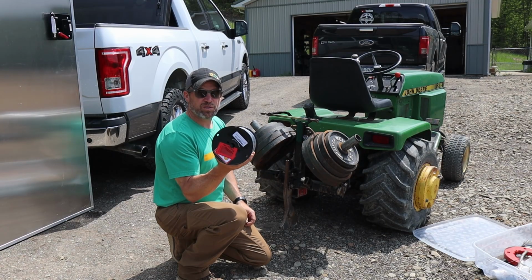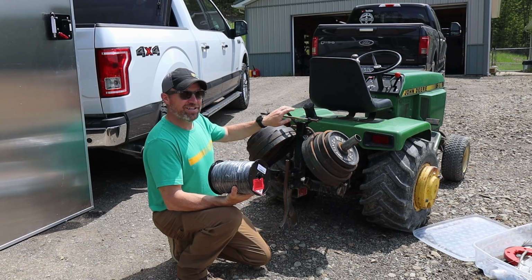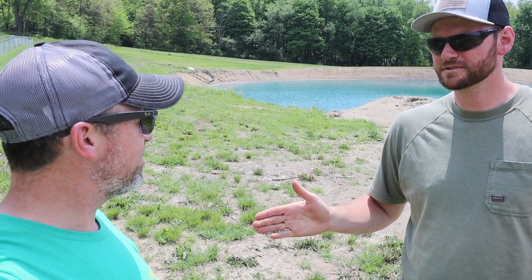Okay, we're just getting everything scoped out, what they want to do. That's kind of the first step when you want to do a dog fence, is to make sure where you want to put it, measure out your perimeter, and then you can determine how much wire you're going to need and the path you're going to take. You obviously want to avoid as many tree roots as you can and any rock situations or things that get nasty to pull a little knife through in the ground. So Adam's going to enclose about 2 acres or more. I bought two 1,500-foot spools, and I modified this just before we left so that it would accommodate a 1,500-footer. Yeah, because you said, barring any of those obstacles, this wire will be in the ground as fast as you can drive the tractor around the perimeter.